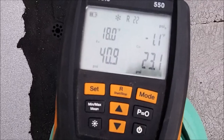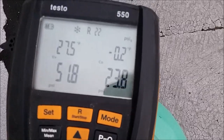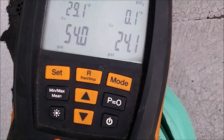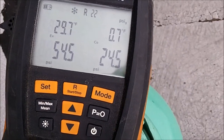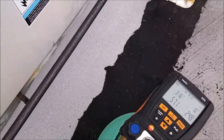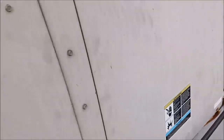As you can see, the left hand side is circuit one on the low side and my high side goes to circuit two on the low side. Circuit two is very, very low. Circuit one is kind of low, but definitely circuit two is the one that's low. Going to let it run for a minute — actually going to go get my leak detector. Circuit number two just dropped out on low pressure. Circuit two is out.